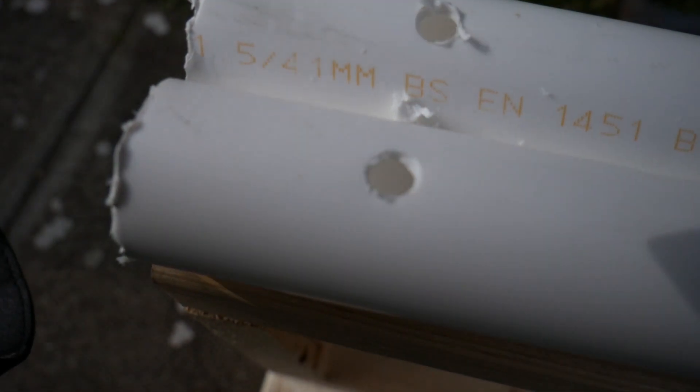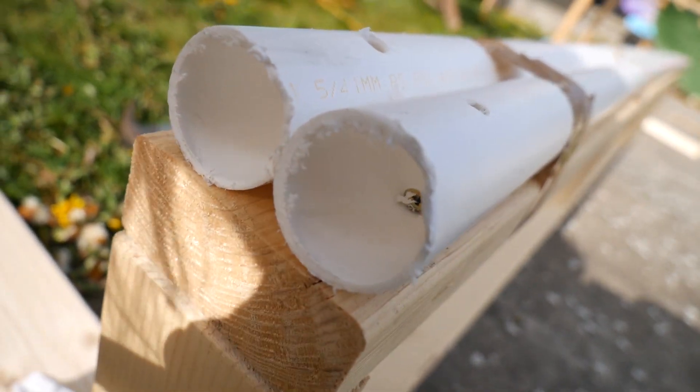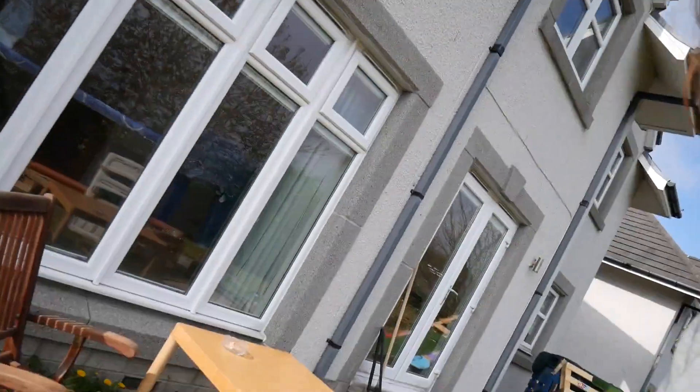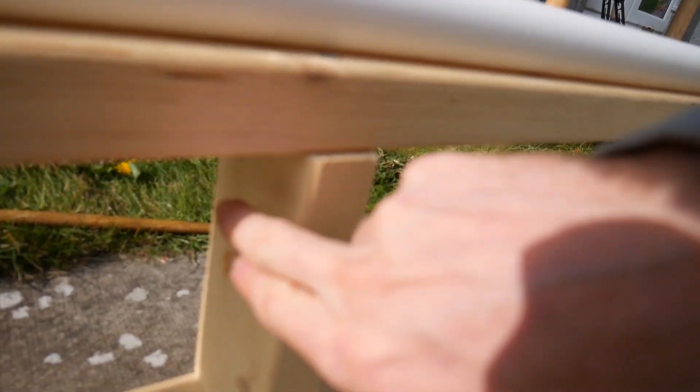So now from above that's nice and smooth. If we come in here you can see that screw sort of brought into the bottom. We're going to keep doing that — we've done that on the end, we'll do that maybe four times on the rail on each tube: one up there, one in the middle, one a bit further down, and one on the other end. Obviously as you're going through, the screws will stick down into the frame, so think about where you want to put them. I put mine as close to the legs as possible, so you're not going to get stabbed.